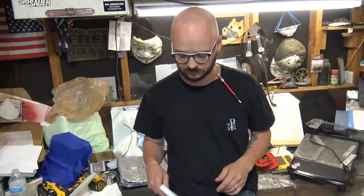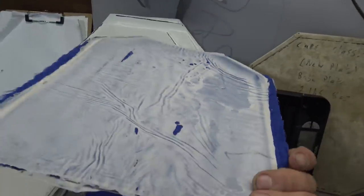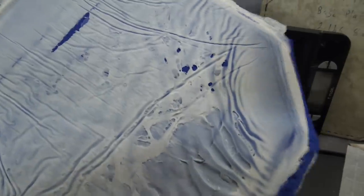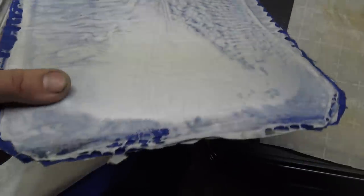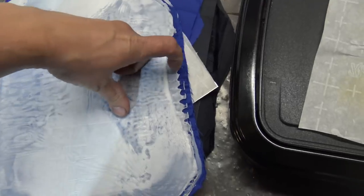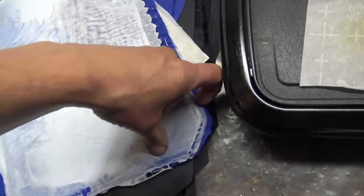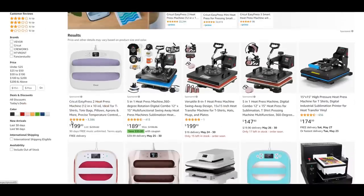I first started by trying my original method of laminating HDPE into fibers: placing HDPE film in between five to six layers of nylon, clamping it between two metal sheets, and placing it into an oven set at 350 degrees Fahrenheit for about 30 minutes. This process does work, but it takes a lot of time, oven space, and can really smell up the kitchen.